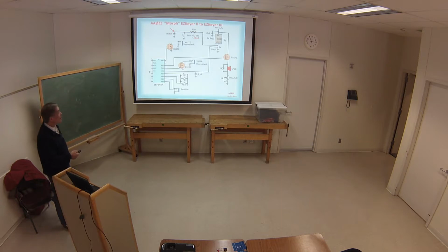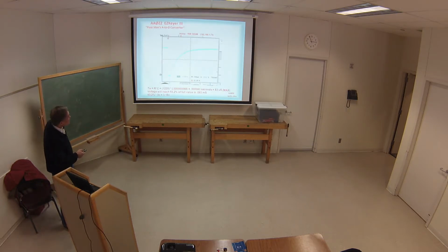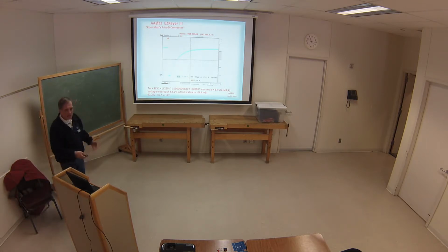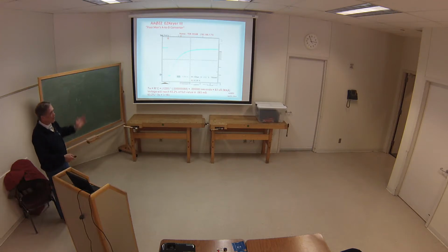So now what's it going to look like? Well, that's hard to see, isn't it? You can see the line here, the normal capacitor. This is where I hold it down with the pick, and then I release it, and it's going to take a capacitor charge cycle like that. Now, from electrical theory, tau equals RC. A tau is a time constant. So typically, what a capacitor will do is it will go up, it'll reach 63.2% of its full value in 1 tau, and then you go another tau, and go up another 63% of that.